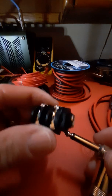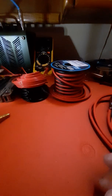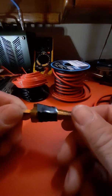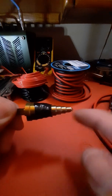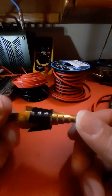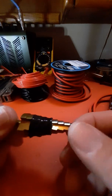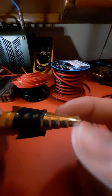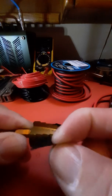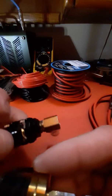That's how easy it is — quarter-inch female switch jacks from Amazon, real cheap. Get yourself a step bit from Harbor Freight, just a couple of dollars. I recommend it because it drills very controlled holes and won't slip, slide, or damage the front or back of your chassis. Because of the steps, it drills very controlled holes in the chassis. You'll want to go to about 7/16ths — this one is marked up to half inch — and that will be the correct diameter hole for the jack to poke through.